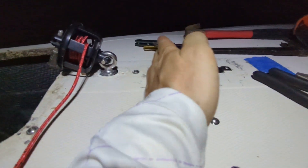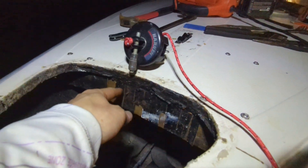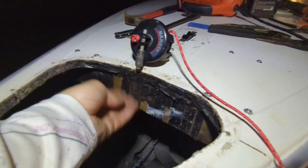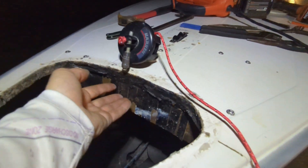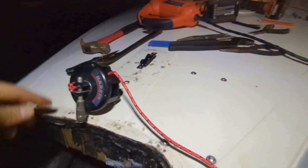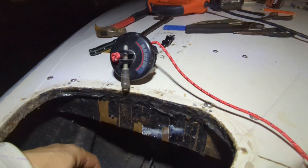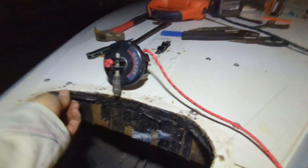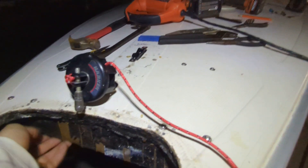So bring it in a little bit, and then two horizontal. I'll probably do like a mortise and tenon right here on the bottom one, and slip it into this other member. Then I'll glue them all in place with epoxy right here. I've got a little fiberglass and epoxy and I'll probably just tab it all in — I'll probably wind up wrapping it all. But it's kind of a pain to work on under here.